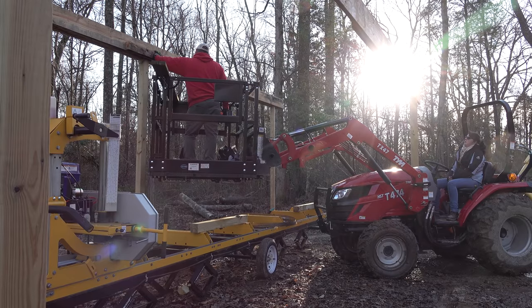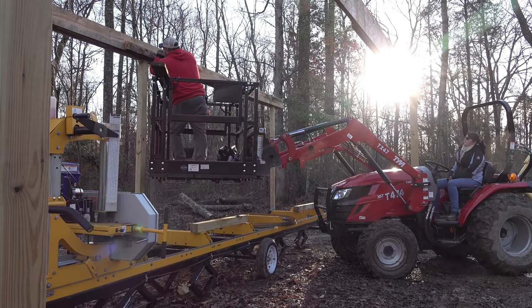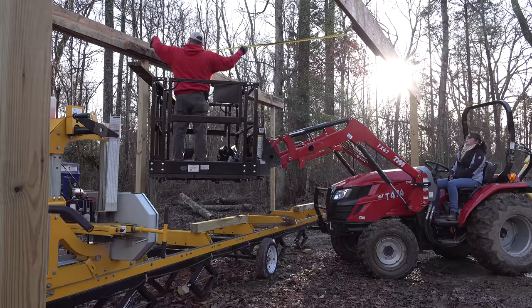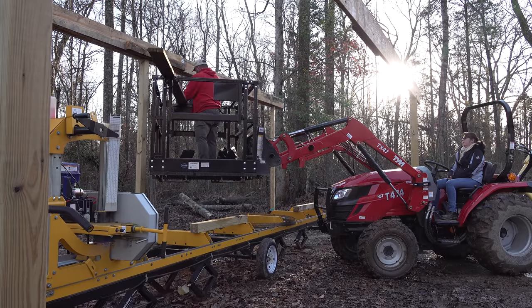Why don't you lower the board just a little bit? It gives you more room. I'll just cut out a 2-inch notch. You're going to set it on top of it, right? Over the lip. Yeah, but I've got to measure first. You're going to set it on top, so I have to raise you because you have to be higher. So we're looking at give or take 115.5 inches. I'll cut on this end. 115.5. Make a 2-inch notch.